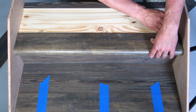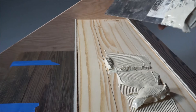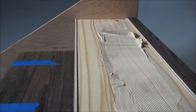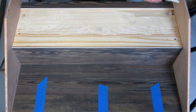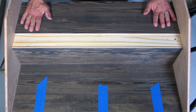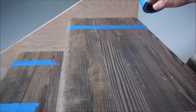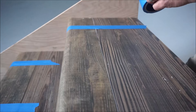When installing adjacent to floating floors or in areas where you may need to change direction, the process is slightly different. You will use the same procedure in preparing and installing the nosing, except that you must direct glue the plank that adjoins the nosing or a minimum of six inches of flooring. Always use an adhesive appropriate for the product you're installing. For this installation we're using Shaw 1500 adhesive for our cork back product. Note that for any Shaw luxury vinyl plank with an attached foam backing, Shaw T180 is the only recommended adhesive. Use painter's tape to secure the nosing and finishing nails if desired. If necessary, weigh down the glued plank until the flooring adhesive has had a chance to cure.